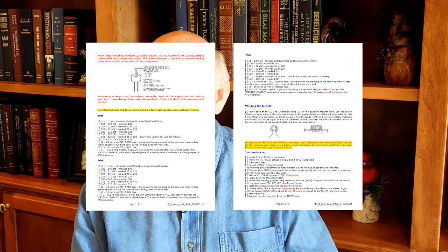Well, that's enough blah-blah-blah, let's get started. The transceiver kit includes printed circuit boards and parts for three-band modules. All three modules are assembled the same way, just with different component values as spelled out on pages 8 and 9 of the QRPGuys instructions. Building the modules is pretty easy. The only real difficulties involve winding and installing the toroid coils, and that's not so hard once you understand the process.